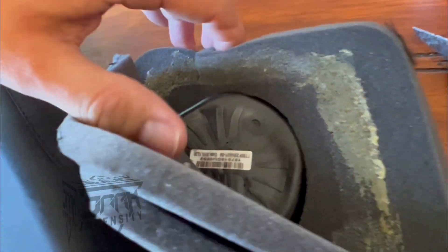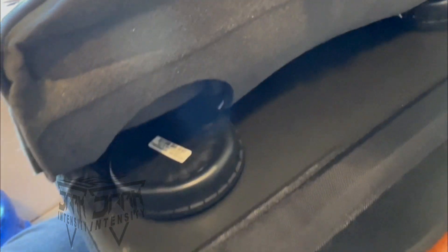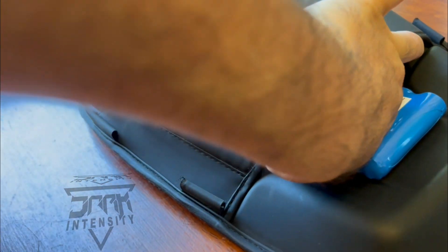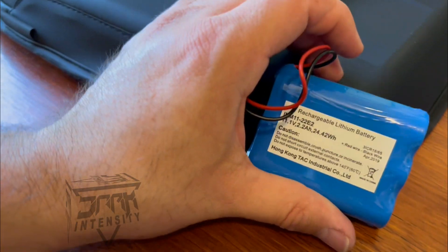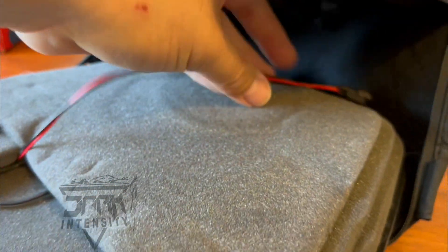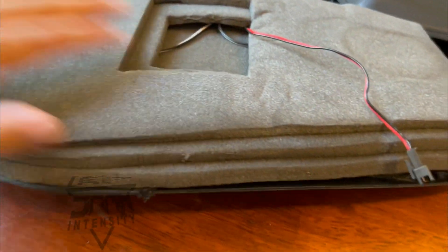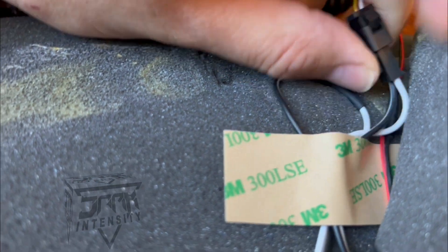As you can see, there are the original transducers. I'm using some angled needle nose pliers to pull back this. Remember to take out the battery — I almost forgot. Very carefully, don't rip it. This is the battery wire, I'm just gonna pull it out so it doesn't get in the way. There's another wire which is the audio signal — we're gonna unplug that one too.